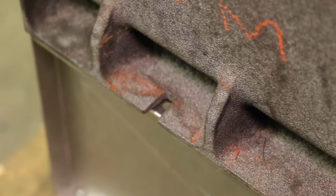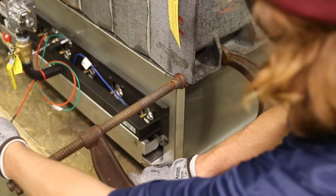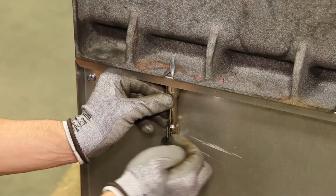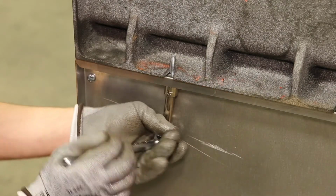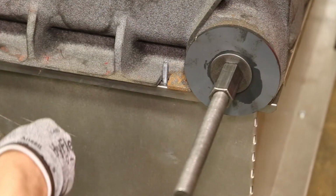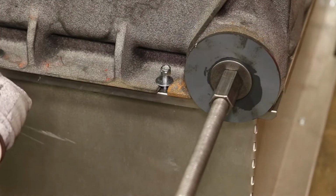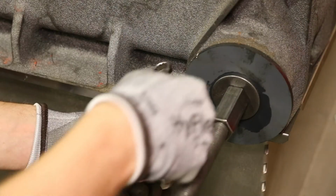Verify the alignment of the holes on the base of the right side section assembly with the holes on the cast iron assembly, and perform any adjustments as needed. Thread two 5/16 bolts through the holes on the base and section assembly. Place a nylon locking nut and washer on top of the bolts. Then tighten to secure the section assembly to the base.